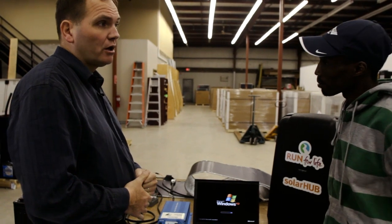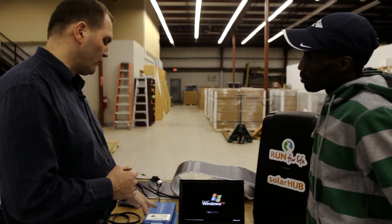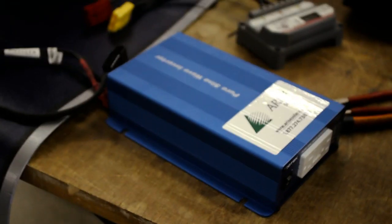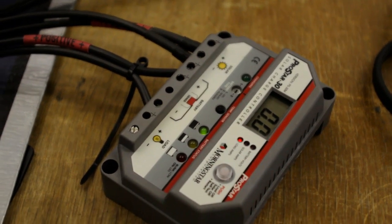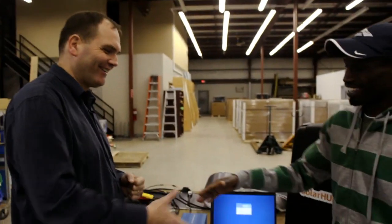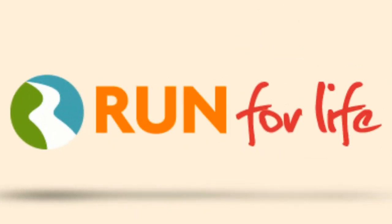The size of this system is designed for running a laptop for four hours a day. Laptops are about 100 watts, which is a fairly large draw of power. Tablets are much lower, and cell phones are clearly lower — around four to seven watts — so you would be able to run them for a much longer time. The key limitation is giving the system enough time to keep the battery fully charged throughout the day.